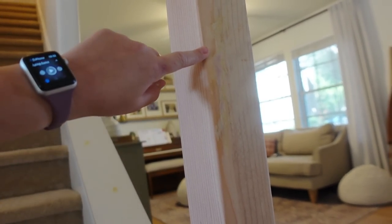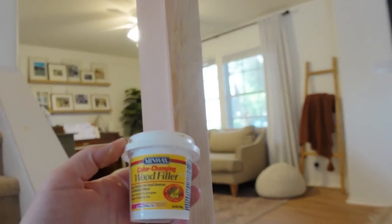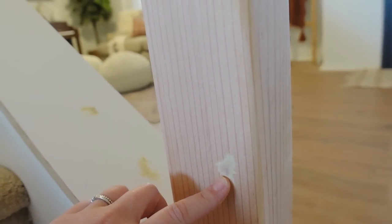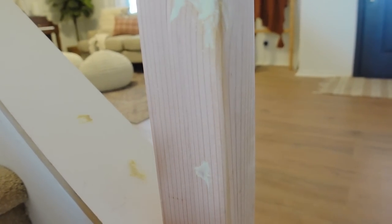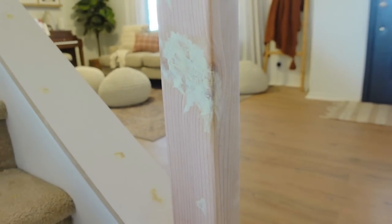For these smaller little pieces like that, I am using this Minwax wood filler. I've talked about this on my channel before. It goes on pink, you can see right here, and then it dries to this tan color. Whenever it's completely dry, then you can sand it, because I'm very impatient, and if you try to sand it too soon, it will gunk up on your sander.